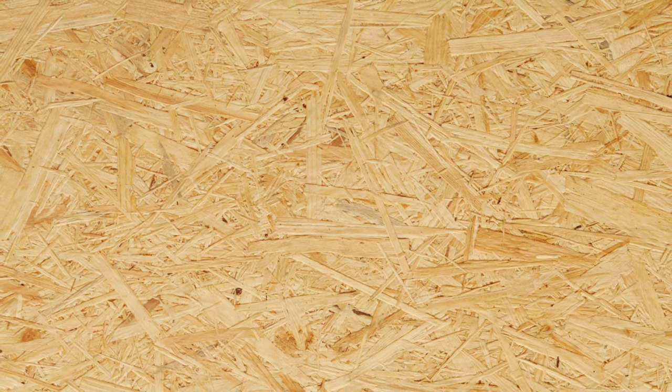That's where you have to pay attention and be careful. As long as the pullout values are similar enough, depending on the varying thicknesses of OSB or plywood, it still works with Sheffield's engineering. We usually recommend 5/8-inch OSB if you're going to go with an OSB application. Some companies have tested over OSB and whatever they tested over is going to be fine. But all wood decks aren't created the same — you have to make sure of what you're attaching to, the type of material, thickness, and things like that.